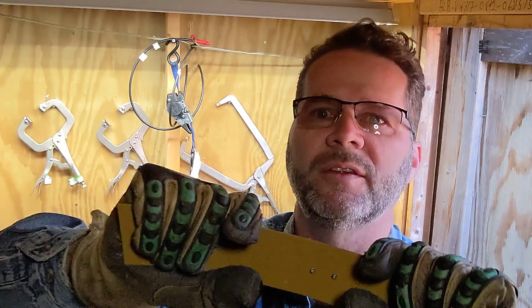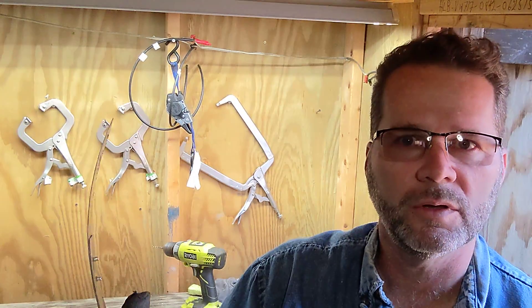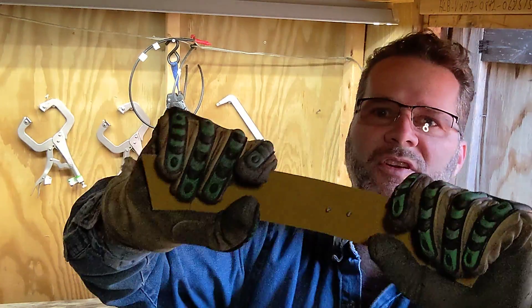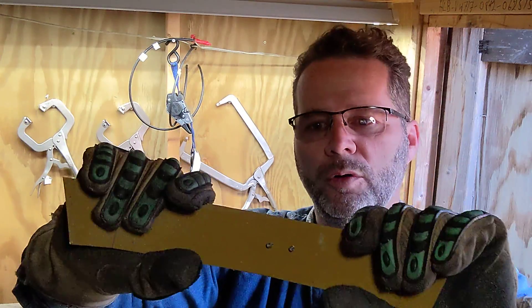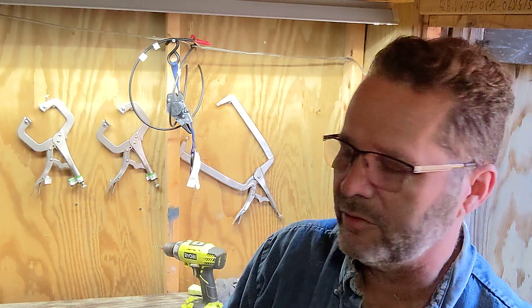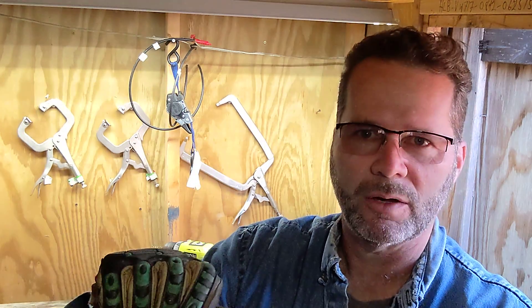I could use spot welds, but that would require clean base metal. If you're concerned about whether this has the strength to hold the entire assembly together — these rivets are steel, so they're not going to melt any more than the sheet metal would under temperatures of 1,200 plus degrees once secondary combustion kicks in. These two rivets together have a combined holding strength of 500 pounds. Each one of the Amicus smokeless fire pits has close to 50 rivets altogether holding the sheet metal together.